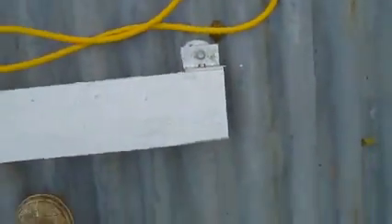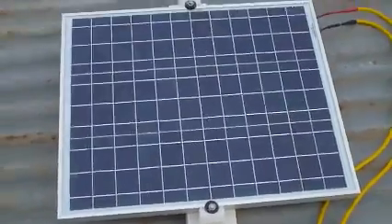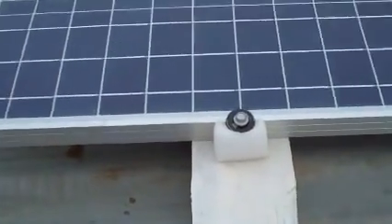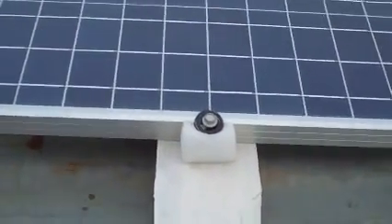It's all been cleaned up and painted — you'd think it was a bought one. I used these aluminium angle brackets, a bit of silicone, and just tech screws into there. This is a 50-watt polycrystalline panel, and I thought one-by-four timber should be enough — and it looks like it is. This is pretty solid.